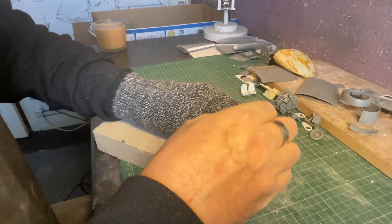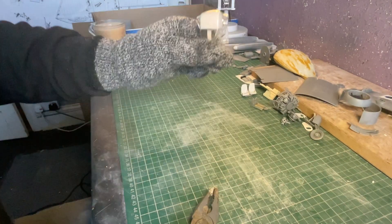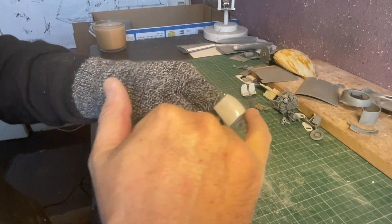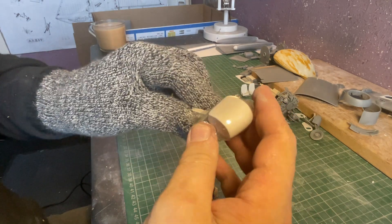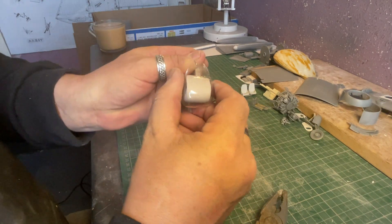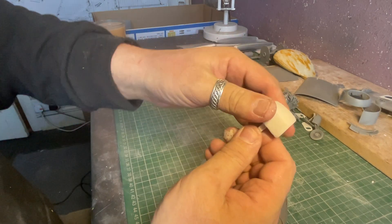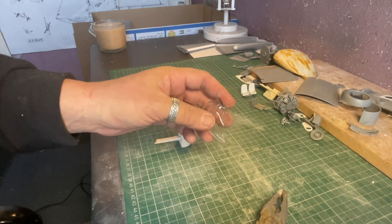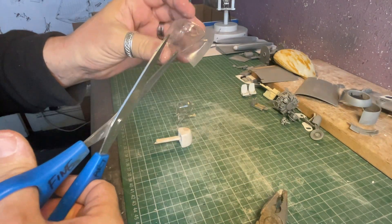Make sure the edges are all pushed down around. Once you've done it a few times you end up with asbestos fingers. We can see now, with a few seconds' work, we've got a perfectly usable canopy — trimming all this flash off is very easy. This canopy I'll throw into my spares box in case I need to plug anything again. The mold was polished before I did anything to maintain that shiny finish. There's a perfectly usable canopy hidden within all the rubbish surrounding it.